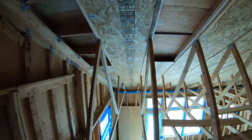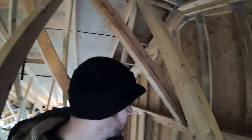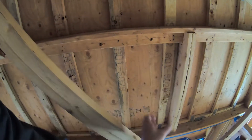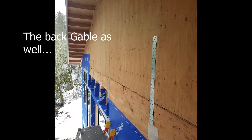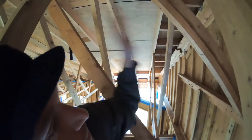I would hope that those hurricane clips could hold it, but since this is going to be our house for our family for generations, I don't ever want to have to worry about it. So I spent an extra few hours and really beefed it up. You can see I got double two-by-sixes there, there, there, and there — they all line up with double studs in the walls, except for this one, which goes to the header. Then I've got thick, beefy straps nailed into that and down into the studs or the header, and down into the studs below. And I also added this brace here, so I think we're going to have plenty of racking resistance.